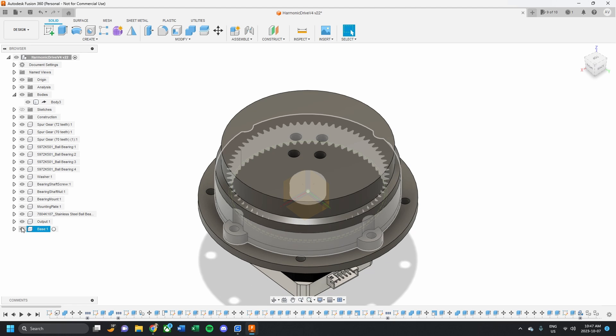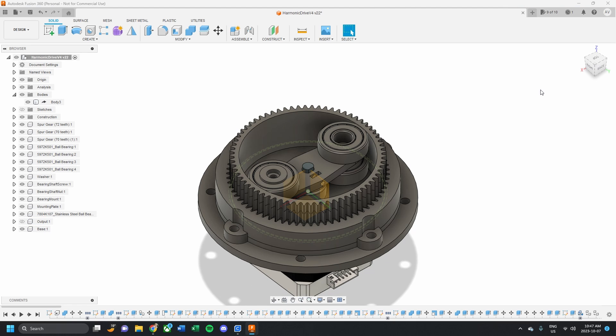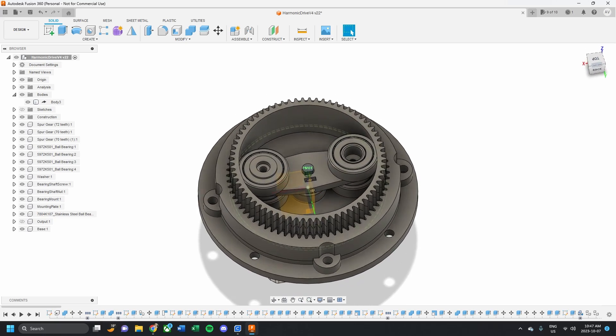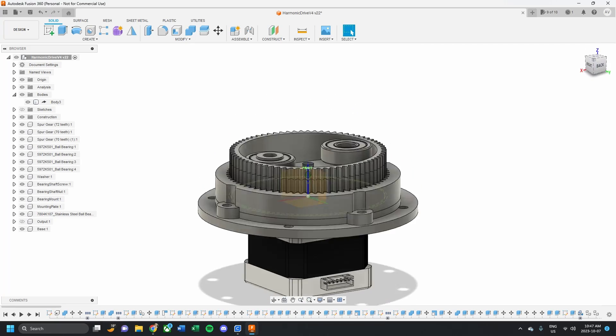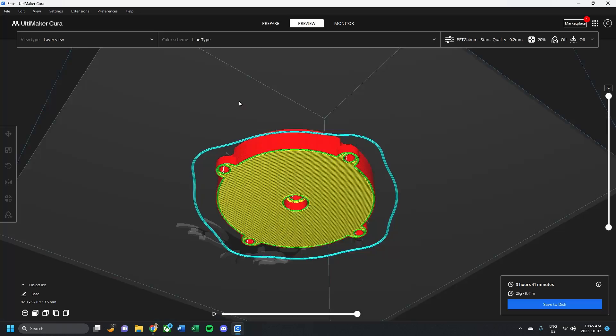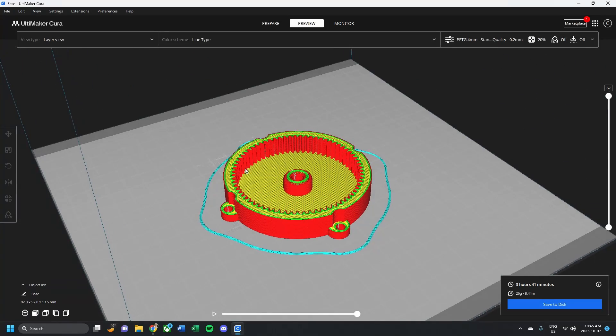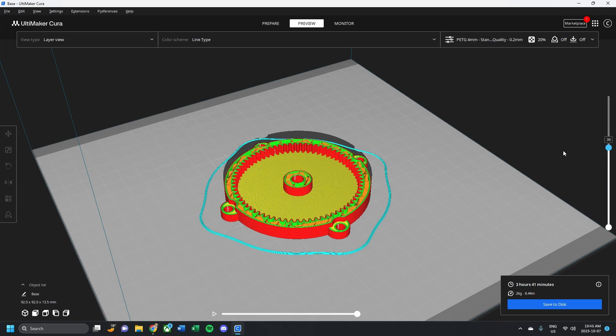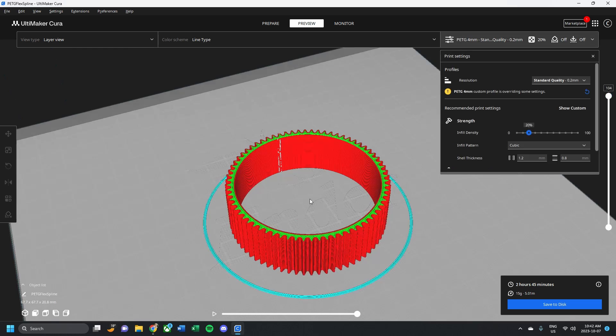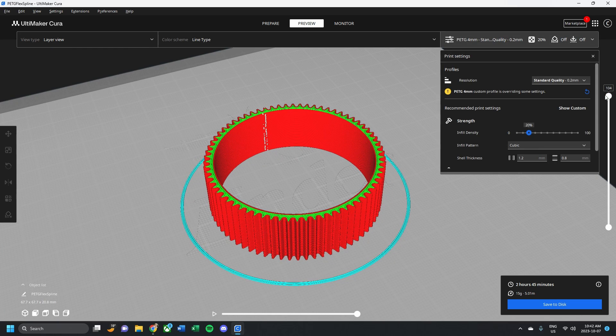And it's also cool to see something made in a unique way. I chose to start with the harmonic drive because it's much easier to bring to almost no backlash and the teeth are in constant mesh, so the gearbox locks up on its own when it's not turned. I got the inspiration from a bunch of different YouTube videos people already have out there, and this general design is mostly what people use as it's pretty simple and easy to make.